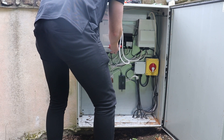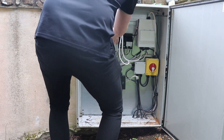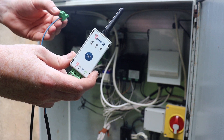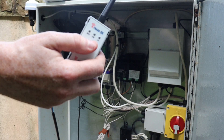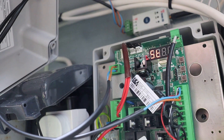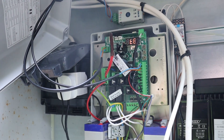Firstly we'll open our cabinet and install the e-trans 50 onto the gate operator board. Make sure as always to cut power to the system before doing any wiring work. It's pretty straightforward in here — we just find the 24 volt power out on the board to power the e-trans device and then wire into the relay. We then find a good place for the e-trans inside the cabinet; it's quite small and comes with a really good adhesive backing to fix it within cabinets like this.